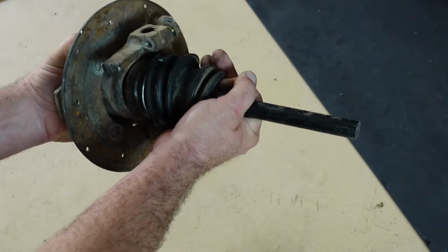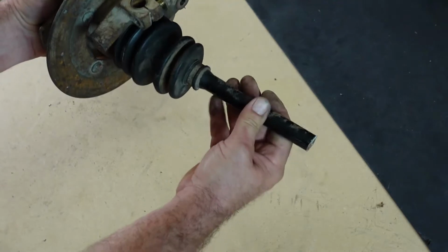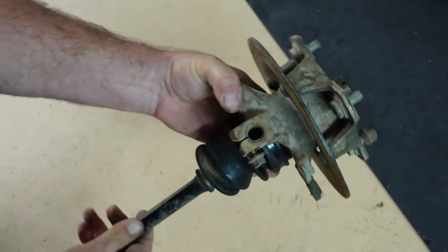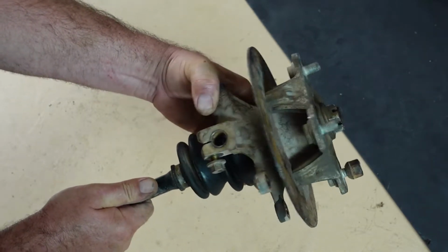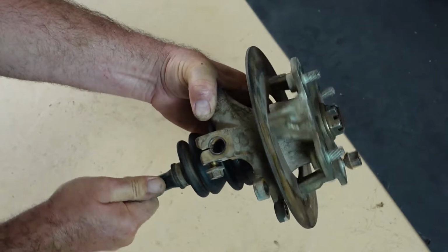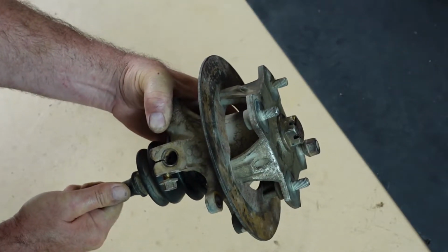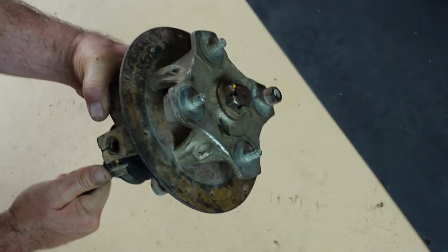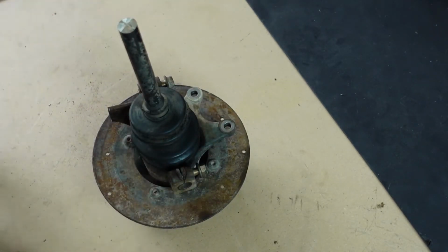You know, it'll lock it into that. Oh, I took that strap off. But yeah, it'll lock that into there. So let me see if I can hold it like that. There it is. And so those bearings will have it go up and down like this, and then when I turn this shaft a little bit with a servo, that will give us the rotation. So pivot and rotation for the shoulder. It'll be pretty awesome. I'll make the bracket for you guys next on this.